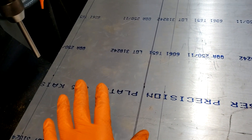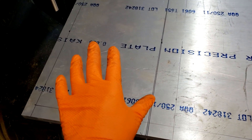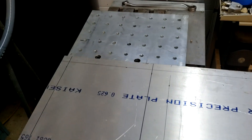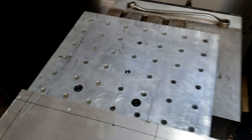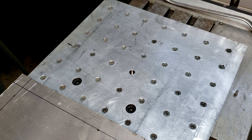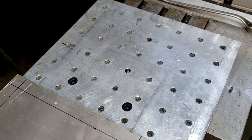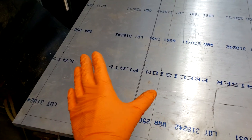I can't lift the piece up on the table any higher than it is, so I'm going to have to set this up on three blocks. On my mill table, I already have a table that's been machined on a VM-3, both sides, so it's relatively flat. It also has holes every two inches, so that's fairly accurate. I'm not going to machine the surface of this — I'm just going to put the holes in.